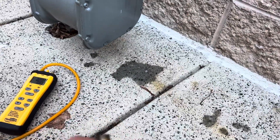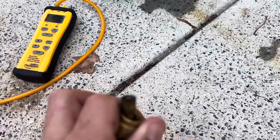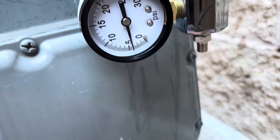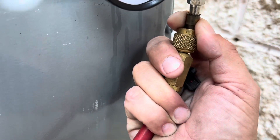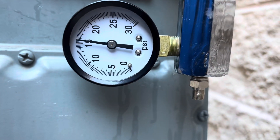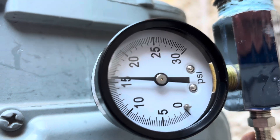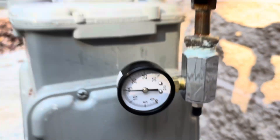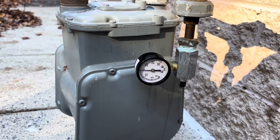I already put a little nitrogen in. I pull my fitting back so the valve core depressor is showing, turn it on, and press it onto that air valve — it won't lock on, but you can push it on and fill. We overshot a little bit, so we backed that off. Dead nuts 15 psi. The gas line inside is confirmed capped off. It's been about 10 minutes and we're still dead on 15 psi — going to give it a couple more minutes just to make sure.